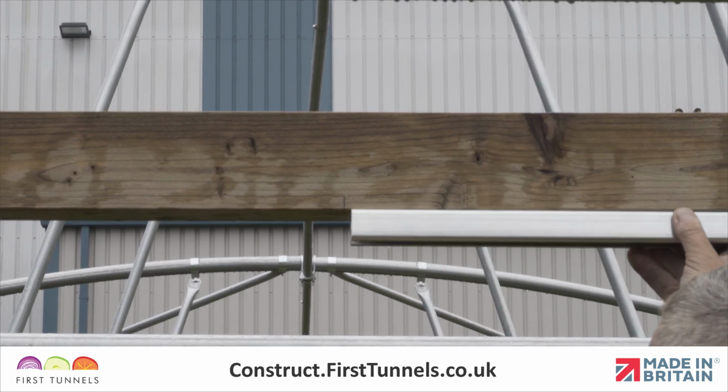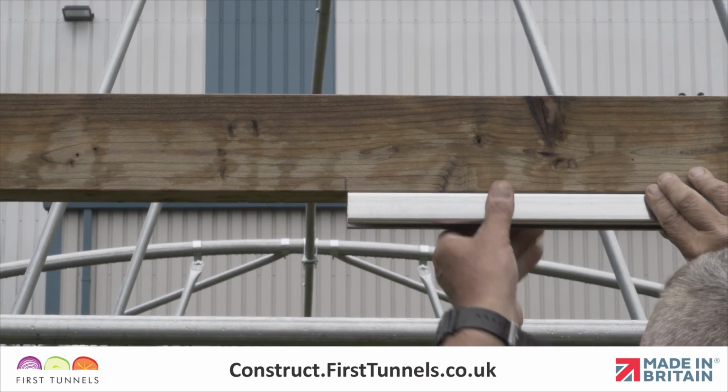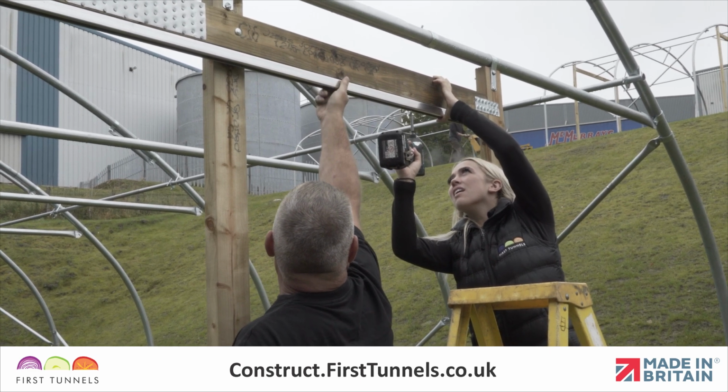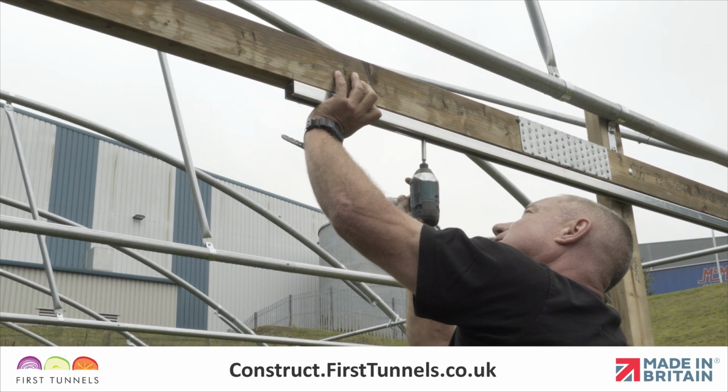Position one piece of sliding door track so that one end is butted up to the centre mark. Do not be concerned that the track does not reach the outer door frame post. Ensure it is flush with the front face of the door frame lintel and screw into position through the 4 pre-drilled holes on each piece of track.